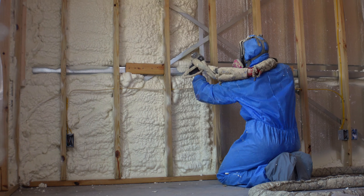There are two main types — closed cell and open cell. We're focusing on open cell since that's what we used in our barn build. Open cell spray foam has a good R-value per inch, keeping your home comfortable year round. It creates a tight seal reducing drafts and saving money on energy bills. It also allows some moisture vapor to pass through, helping prevent mold and mildew. Compared to closed cell, open cell is lighter, putting less stress on your roof structure, and it also helps dampen outside noise.